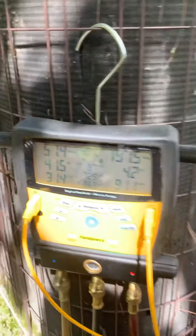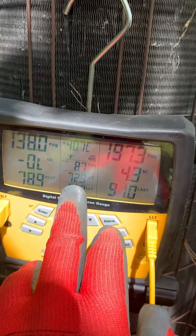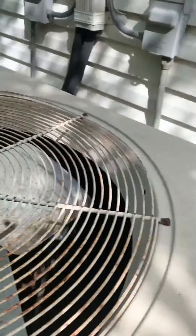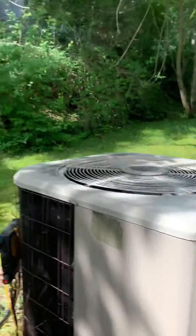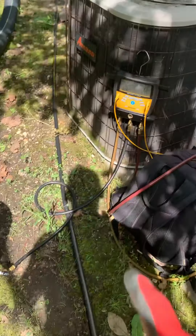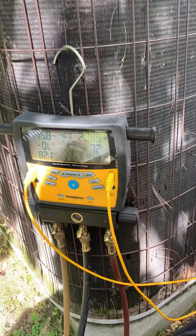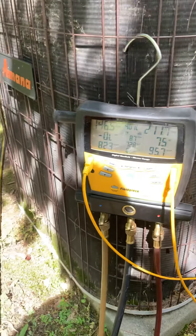A little over a pound — let's shut this down. What's happening is we're introducing refrigerant into the condensing unit and filling up the coil. It comes in as a gas right out of the compressor as hot gas, goes into the coils, the fan cools it down, condenses it. By the time it leaves past the filter it should be a full liquid line going straight up to the metering device. Then when it hits the metering device it drops from about 200 psi down to 50-60 psi, and that's when the cooling process happens — it turns back into a gas. So we want that subcooling to be decent and the superheat around 10.